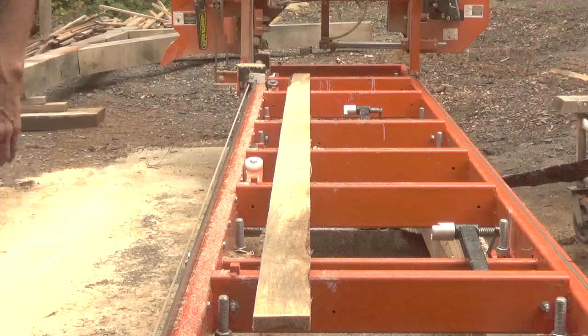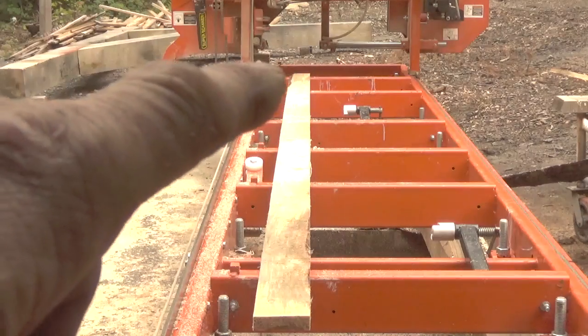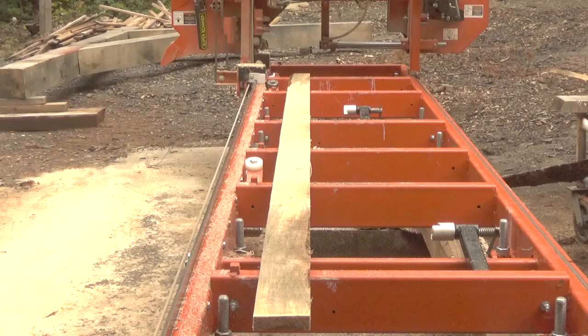Cutting lumber, sometimes you have to play it smart. Now if you look at that board, there's a little bit of wane at this end and there's some at the other end on this side. If I make that an 8-footer, I will lose the wane on both sides. I'll also lose that blue streak because I can take 2 foot out of each end.